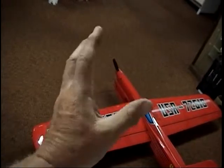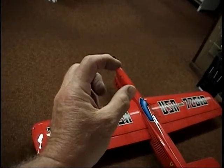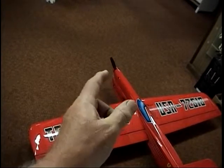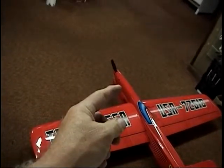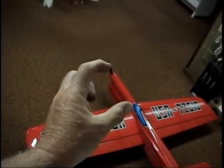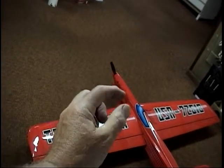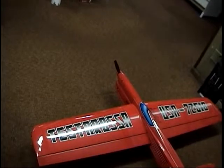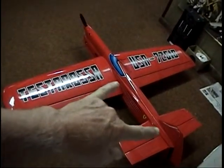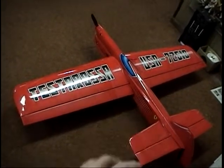Now that I have a lathe, I can make spacers galore. Make a totally interchangeable motor that the 77, 76, and the new 67, not even out yet, we don't even have one, and the 90 would all bolt in. Now the compromise would be, we have a 10-inch nose, Typhoon had an 8-inch nose, and I've been thinking a 9-inch nose would be a compromise going in each direction. Also, with the bigger, heavier motor, rather than using the short tail, extend the tail an inch or two. The Spitfire tail is a 2-inch extension.